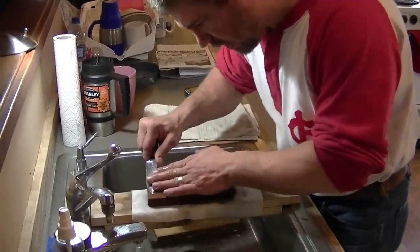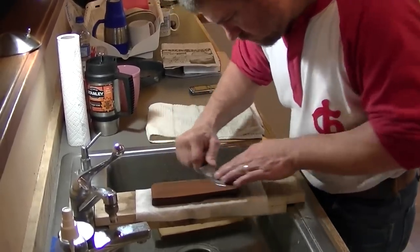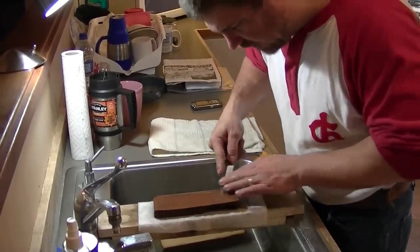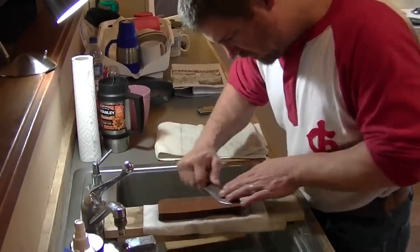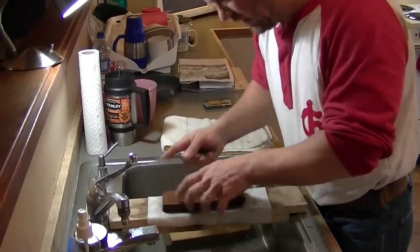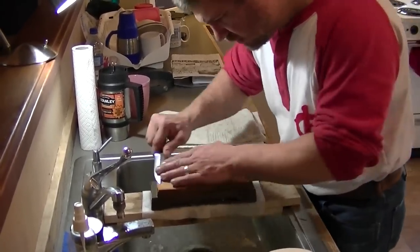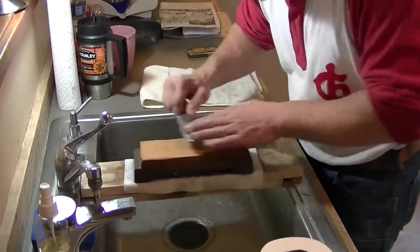My fingers tell me I've established a new primary edge. We're going to strop backwards — I'm taking great care and great concentration. I'm about to get into a test I've never done before. I haven't practiced cutting toilet paper — I tried it once with my straight razor and it didn't cut very well, which puzzled me since I shave my face with it comfortably. I've switched to my 6,000 grit stone and stropping very carefully. You can see it's leaving a little bit of black on the stone, so I know the stone's doing its job — it's abrading.